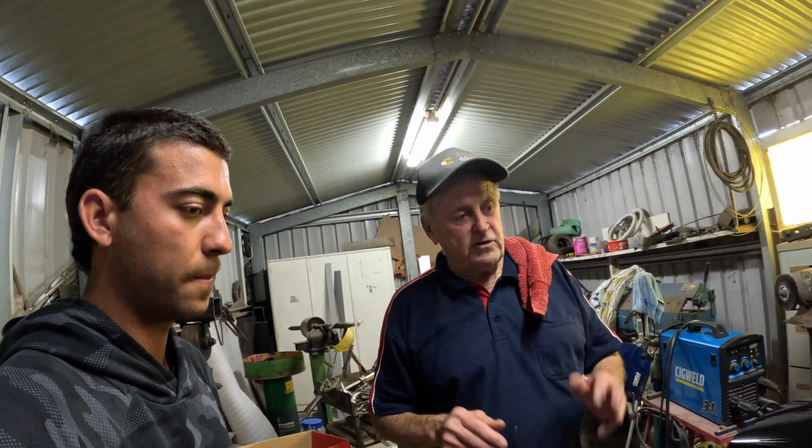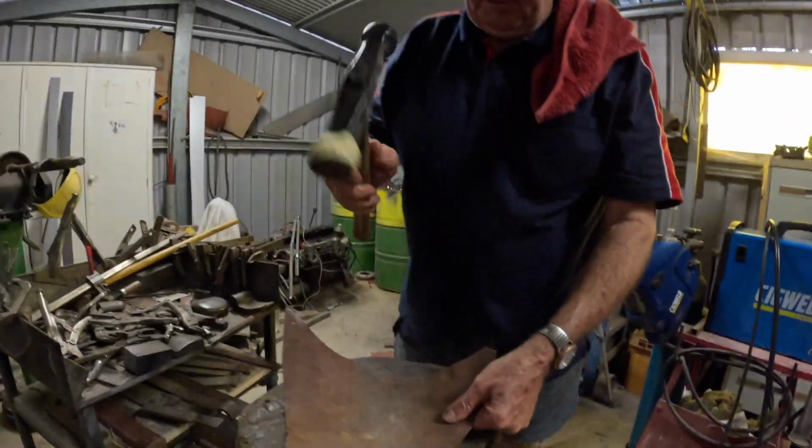Yeah, and that's because it's easier to mould. Yes. So you work on 1mm cold drawn sheet steel. Anything heavier, it's too difficult. Do you want to give us a little bit of a demonstration? Take it off a bit.